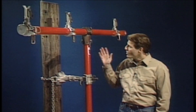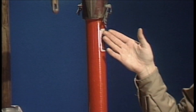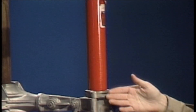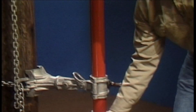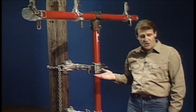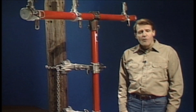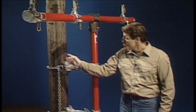This is the type of auxiliary cross arm that the crew will be using. It consists of a fiberglass mast, which in this case has a movable lifting ring at one end. A set of rope blocks can be attached to the lifting ring to raise the auxiliary arm. The mast sits in pole saddles, which are attached to the pole.